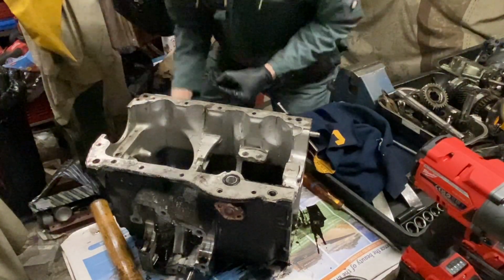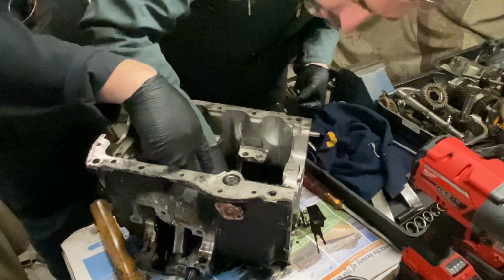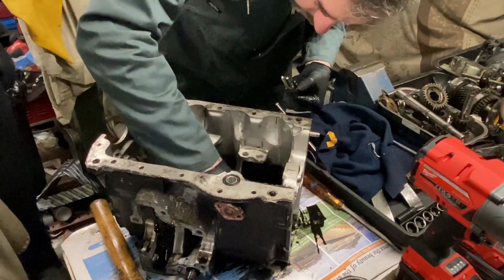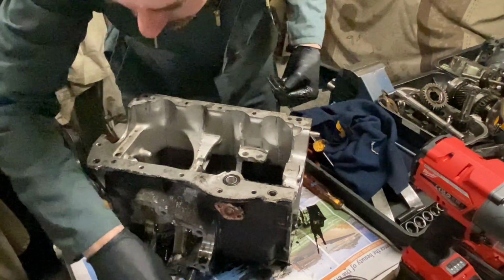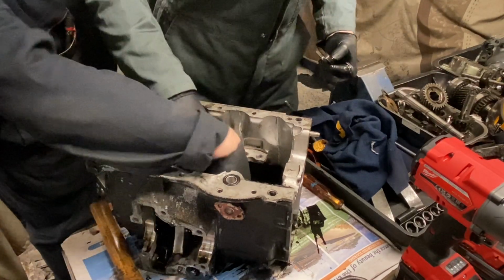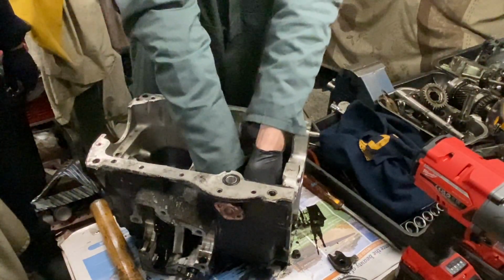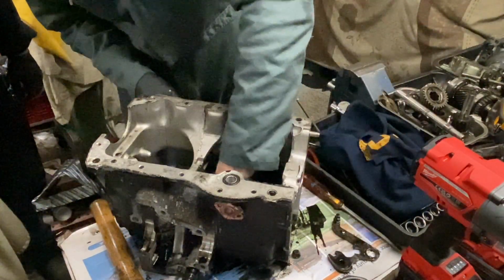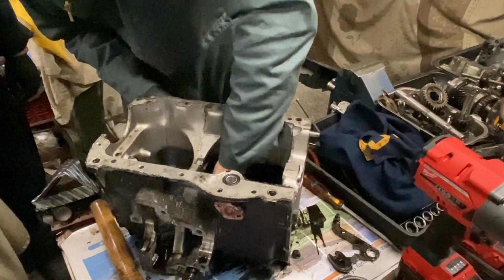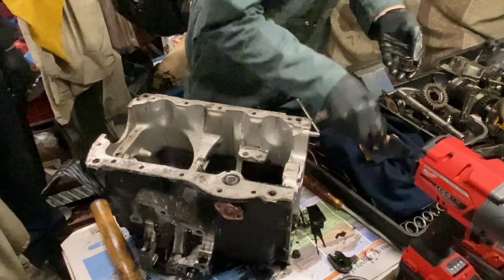I was actually going to say, when you lift that out, just lift the whole stack out in one go. But being you're taking it out, fine. So lift that up as well. Give it a twist and then lift while you twist it to break the seal of oil. You still got the reverse. You need to lift that off. It's just stuck down with the oil, that's all. There we go. And then there's a top hat on there. Twist and pull. It's just stuck down. There you go. You got it. Right, so put them in your metal trays.